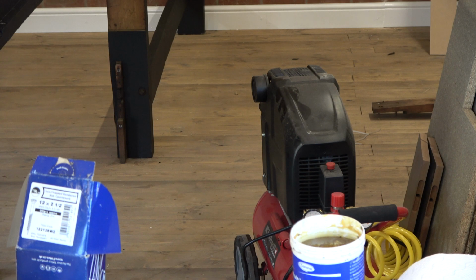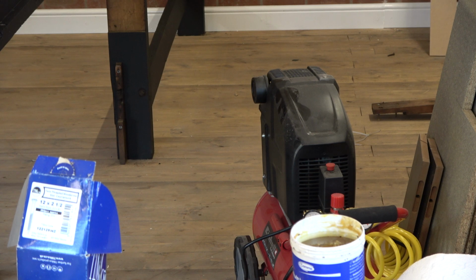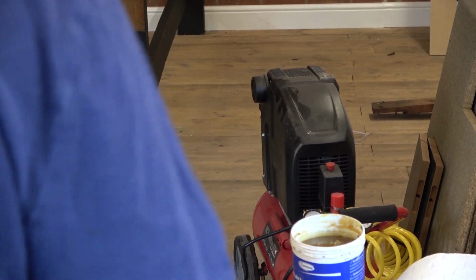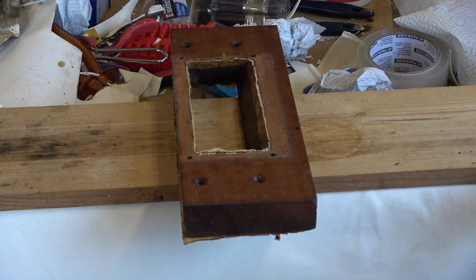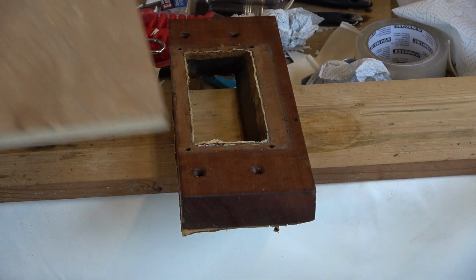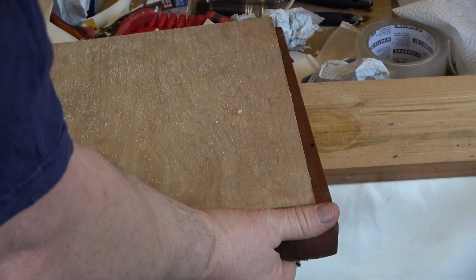So, as you can see, there's a rubber gasket which went to that metal pipe which had the control valve. And then, if I turn that round, I've just removed the gasket material, which is leather, from where the screws are. I knew there'd be some hidden screws, which screw the plate to the trunk. So I've taken those out, and now we're going to split the two apart. So, that's it. The plate is now removed from that piece of trunking.